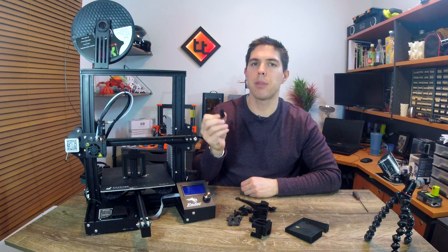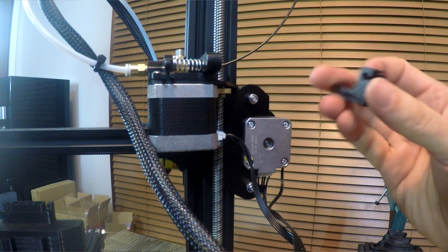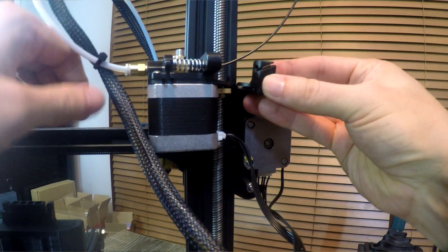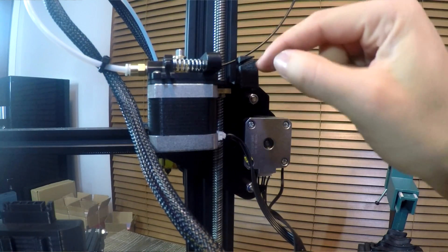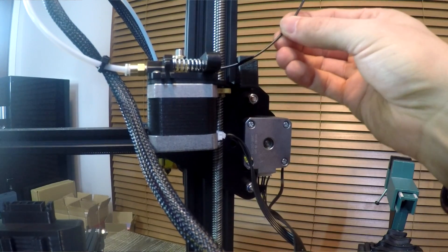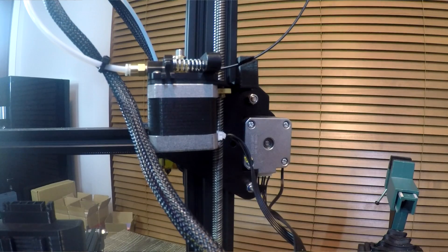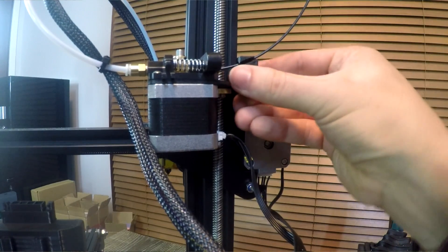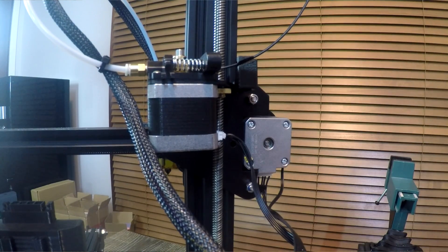This first filament guide is a fast and easy print. I've opted for the open version for convenience — all it does is slide onto the metal part near the extruder and stops the filament from potentially rubbing on the lead screw for the z-axis. You'll notice a little triangle: line that up with the matching part and it simply slides on, sitting flush and clear of the extrusion. Because I've opted for the version with the slot, I just bring it around and that part is finished. It's just a slide-on fit, so you can adjust the positioning very quickly.